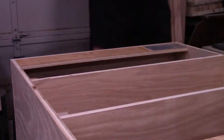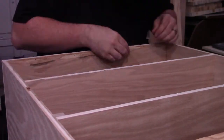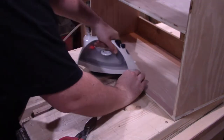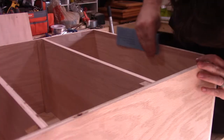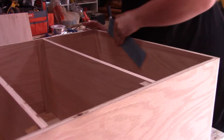This is the unfortunate side of using glue — it made pulling the brace off a lot harder than I wanted and caused a lot more damage than I wanted, pulling off a lot of the oak veneer. So I cut and chiseled out the affected veneer. To fix it, I broke out the iron and iron-on edge banding and patched up the missing veneer. I'm actually really happy with how well this worked out. Any edges left over were easily sanded out, and even though the color matches slightly off, once the cabinets are stained you'll never notice it.